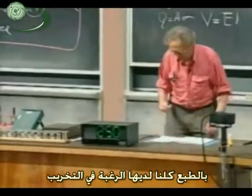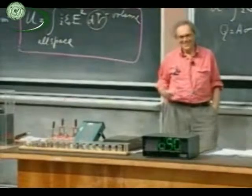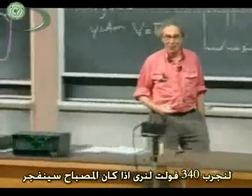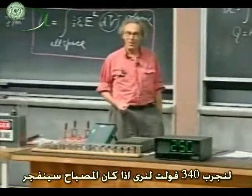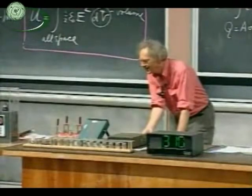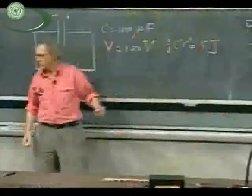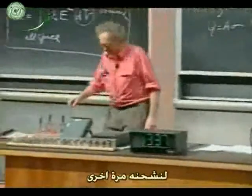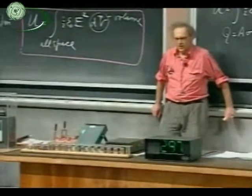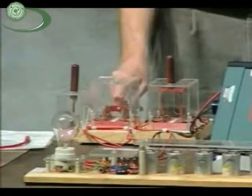You're thinking the same thing that I do — shall we try 340 volts and see whether the bulb maybe explodes? I don't know how high this voltage supply can go. Let's go all the way. That would mean we have roughly 50 joules — it goes as the voltage squared. Let's charge again. We're charging now: 200, 280, 300 — there we go, 337 volts. Now let's see. We did it — it broke!